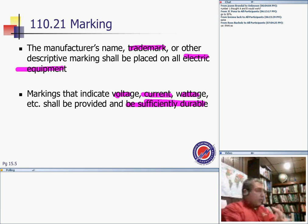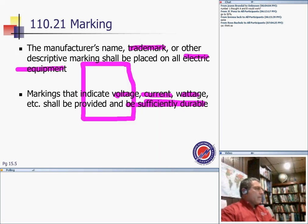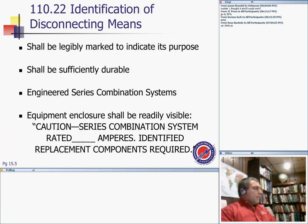What's the voltage, the current, the interrupting rating of the switchgear, the manufacturer of the switchgear, the circuit breaker. So if you look at a switchgear panel that you open, you will have some label that actually identifies a few things, including the current, the phase, three phase, single phase, what's the amps, what's the voltage, what's the interrupting rating of the panel, right in that panel. It'll be almost impossible to work without it.